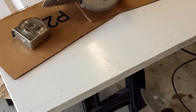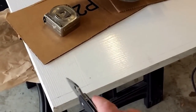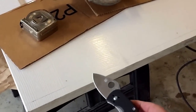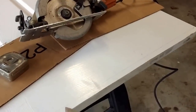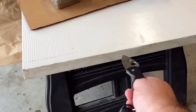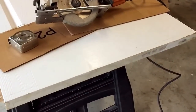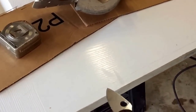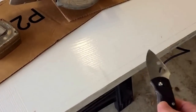This grain of this wood is running this way, the grain of that wood is running this way, and the saw blade is cutting up. So when you come to this grain that you're cutting across, you don't want to splinter that up. This is a crappy masonite door — it's not solid wood. They have wood cores around the edges but they're not solid. So what we're going to do, Barrett, is I'm going to take your sharp knife and scribe that. And then when I cut it, I'm going to stay on that side of the cut and there won't be any chips.